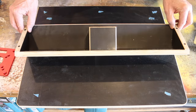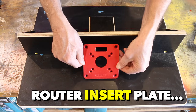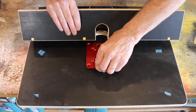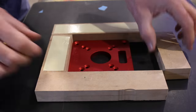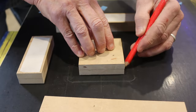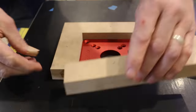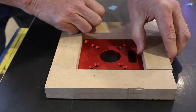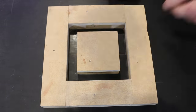With the fence finished, it's now time to mark and cut out the recess for this awesome looking router insert plate that we'll attach our router to. Once again, using blocks stuck down with double-sided tape as a template for my router, I just need to cut out enough so that the insert plate sits flat with the table surface. Just a little tip: to help keep the router flat and level as I'm cutting out the recess, I've added a block in the middle for the other side of the router base to rest on.